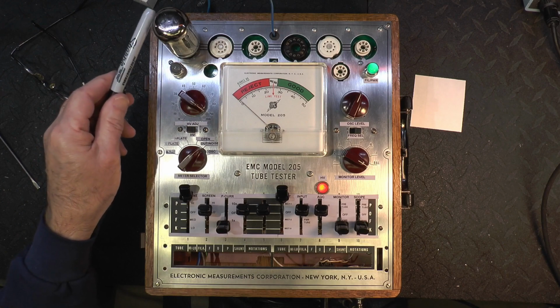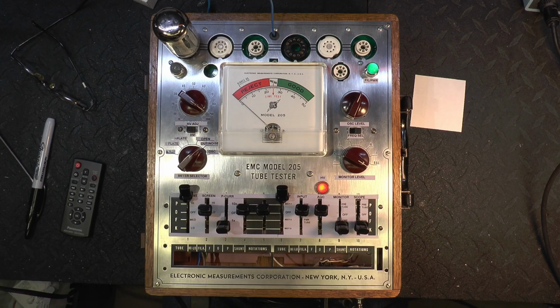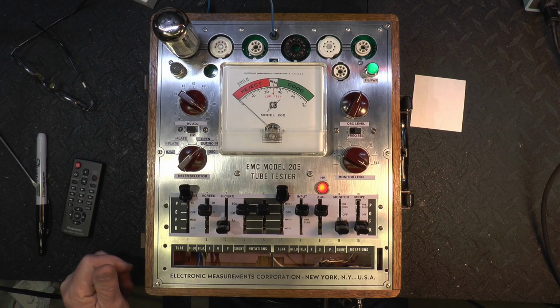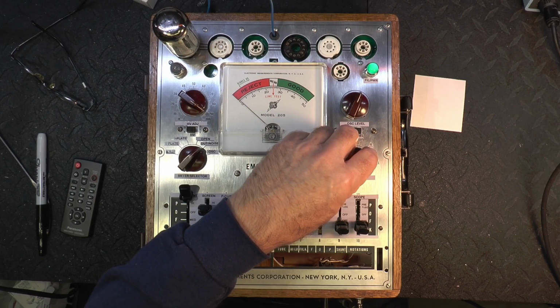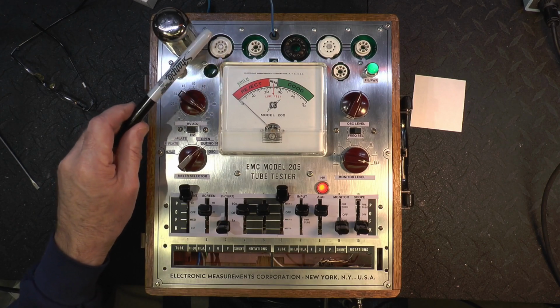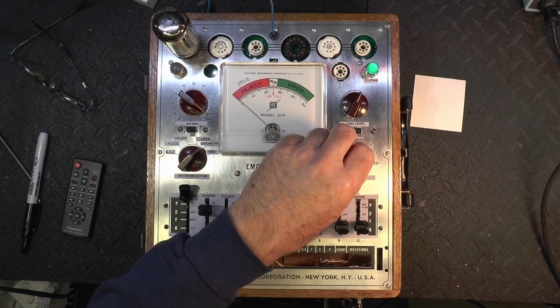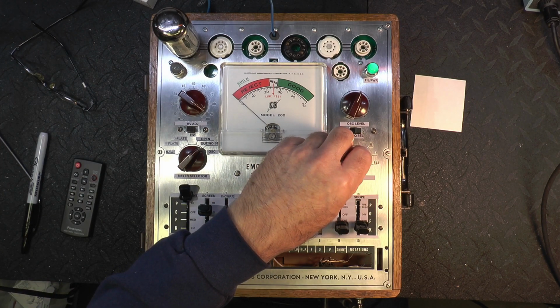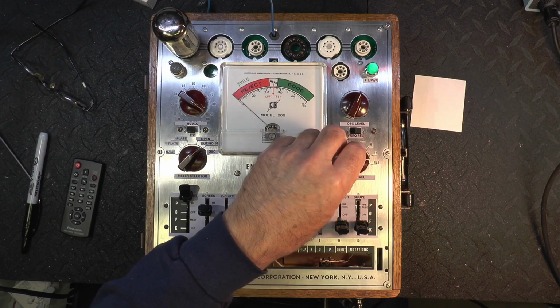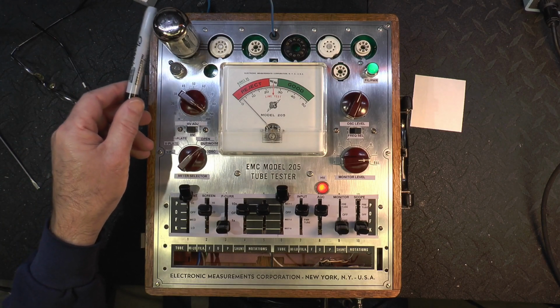All the power tubes are going to have some noise, so with this much gain, you're really looking for hiss and stuff like that too. This is the Kendrick. It's a little microphonic, but probably not too bad in an actual circuit, because this is mainly to find grid issues. This is mostly the glass itself resonating with that much gain. What you really want to look for is some nasty grids banging together, or loose elements inside the tube. The glass resonance is just part of it.